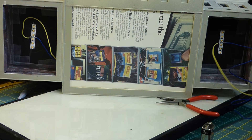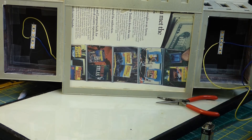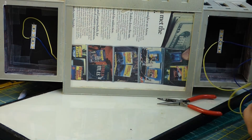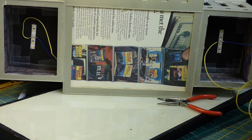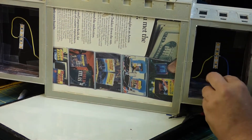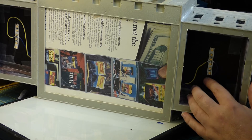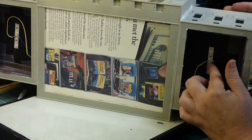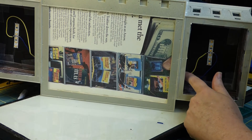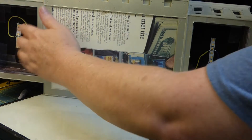Before I push the wires up the hole, I want to make sure that CA has a chance to set up for a minute. I'm going to twist these wires together and start them into the hole, but I want to make sure the glue has a chance to set. The blue one I'm just going to let it go around the light fixture — I don't want the wire going over the light at all. Then I'm going to use a little hot glue to fill up this hole so the lights can't be pulled, and put a little bit right here just to tack the wires in. And that's it.